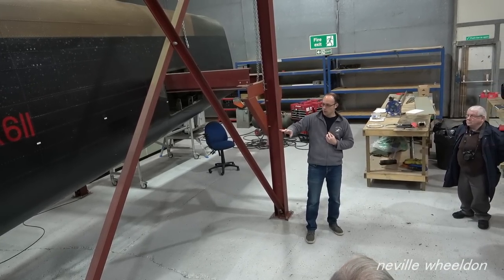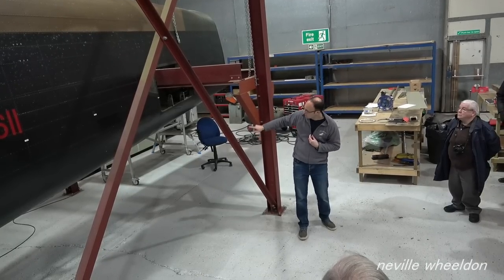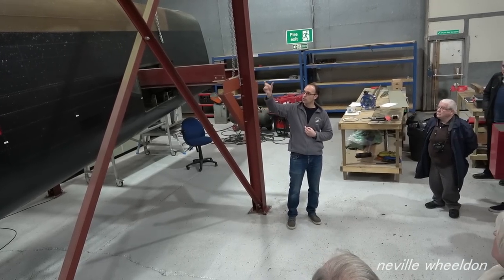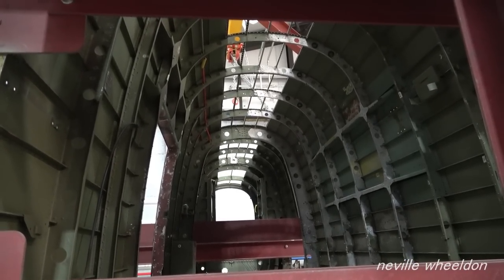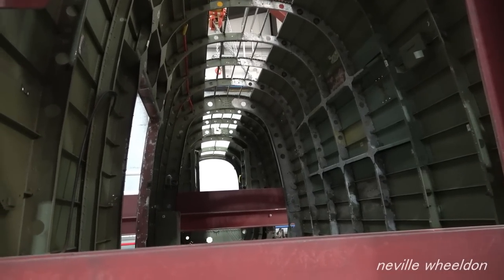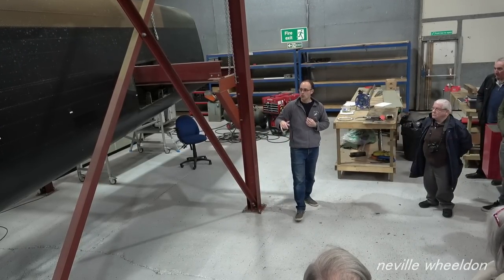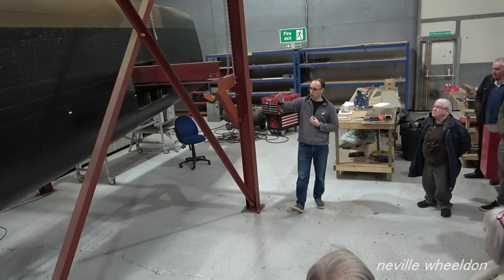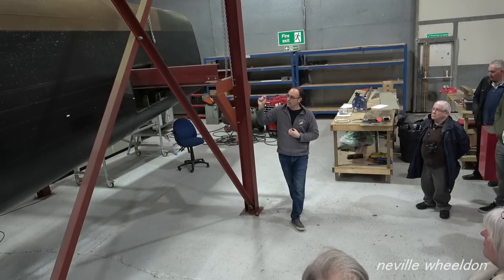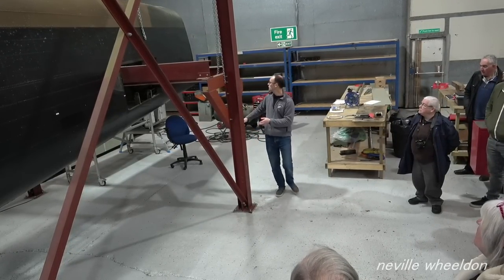What we've learned from doing KB976 in the jig we will apply to NX611. In the next week or so, somebody will come along to produce two more parts of the jig — a top spine and a bottom spine. As you look at the fuselage end-on, you'll see the top skins and bottom skins have been removed. That allows us to place a spine running fore and aft on the jig, and from that we'll have plates that mark the position of each former. We'll then remove all the skins, stringers, and formers — breaking it completely down into kit form.